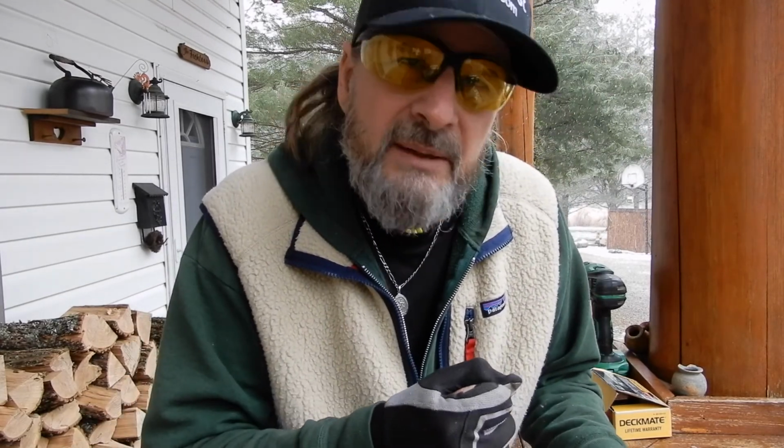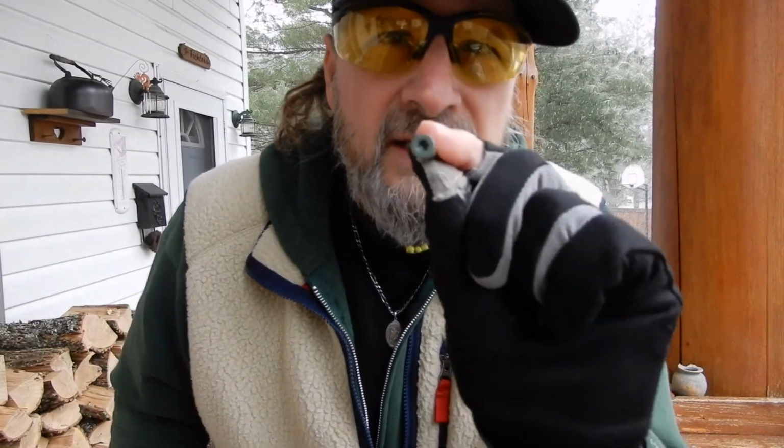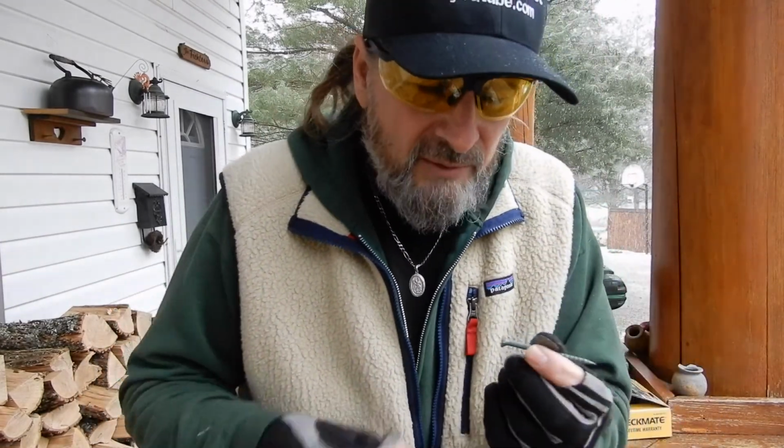You're running a Phillips bit screw inside and it slips out for just that second. If you continue to put that bit back in there and drive that screw in, it's going to get real close to being where you need it to, and it's going to totally spin out, cause you a lot of trouble. Then you got to get vice grips, then you got to somehow figure out how to get it back out to put a new one in. You don't see that with these star bits. These star bits seem to hold pretty good.